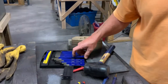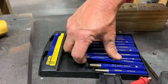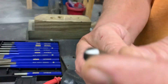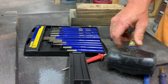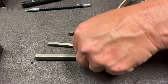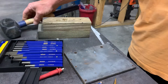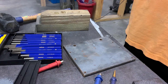So we've got punches, we've got cold chisels, and we've also got some center punches — and this is if you want to countersink something. You'll notice this has got a point on it. These are for hole centering and are used for metal. This is three-eighths-inch steel. If I wanted to drill a hole in this, if I were to just put my drill to it, it's going to spin around everywhere and not dig in. So the first thing I want to do is punch a starter point.